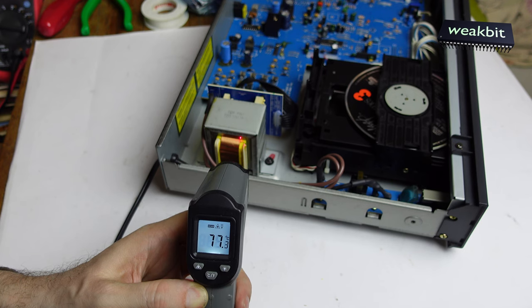I think the transformer has an internal coil short circuit. The NAD C520 CD player was defective due to a thermal issue on the transformer side. I bridged the thermal fuse for test purposes and found that the transformer reached 90 to 92 degrees. This is too dangerous. The internal transformer coil on the primary side was defective and had a short circuit issue. Also, an irritating noise was coming out - like a bzzz sound - and it sounds not normal. If I disconnect it from the motherboard it has the same issue - that means the thermal fuse alone was not the only problem.